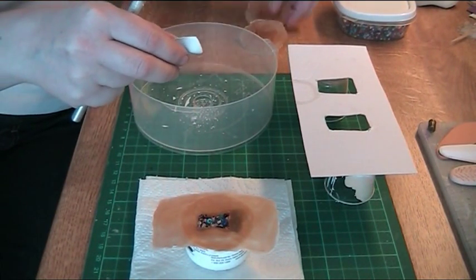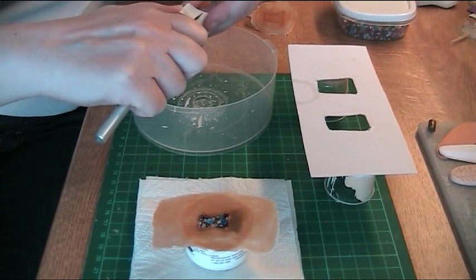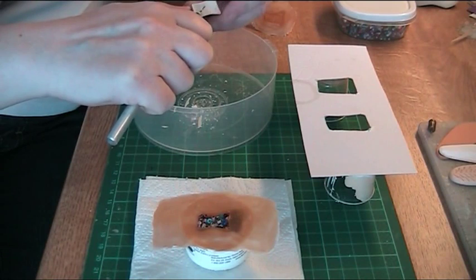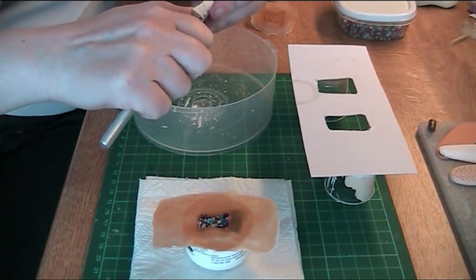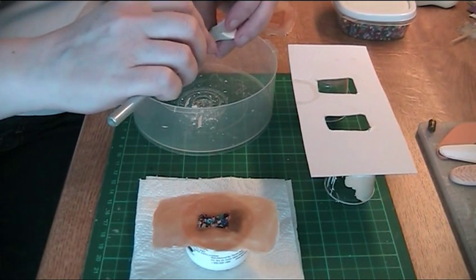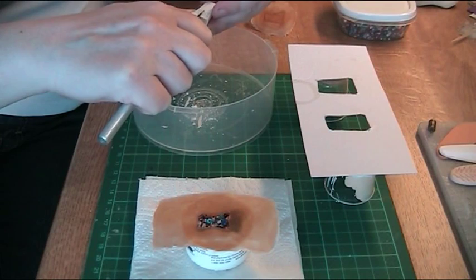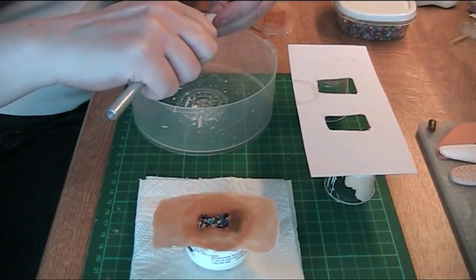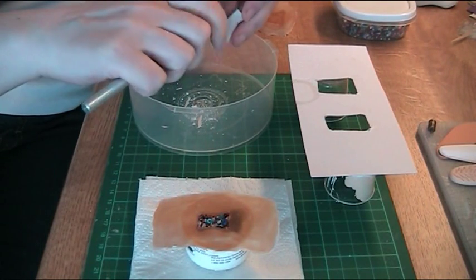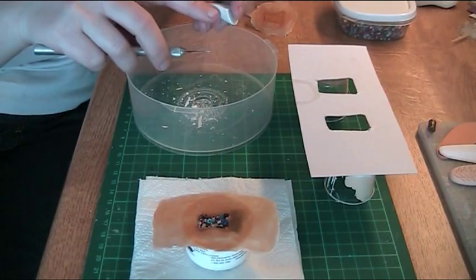It really depends on how thick the plaster is. If it's fairly thin, you won't get these bumps, but the way I mixed it, it was maybe a bit too thick. Could have been thinner, but the problem is I don't bother following the instructions. I just put in water, sort of approximating it. Just pour in some water, and if it looks like there's not enough, pour in more and then mix it. And sometimes it's a bit too much, in which case you can add plaster.